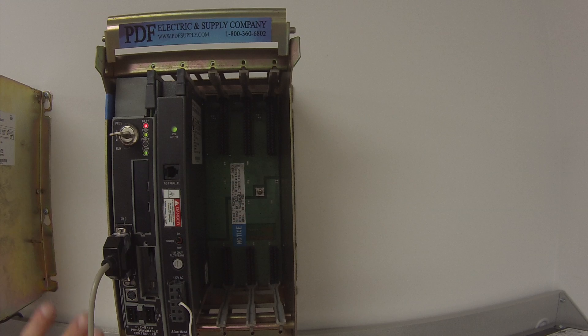This is a simple test — we're going to do two basic things. First, in the software, go to processor status and double-click on it, or right-click and open. Your file S2 status table will pop open. There are tabs at the top — go across to 'Errors', which is in the middle upper part of the screen. We go here to see if there are any faults or errors existing in the processor. In my case I don't have any, but if there are, take note of what it's telling you. If it's something minor or a glitch — maybe you changed a card out — you can just hit 'Clear Major Errors' and continue.